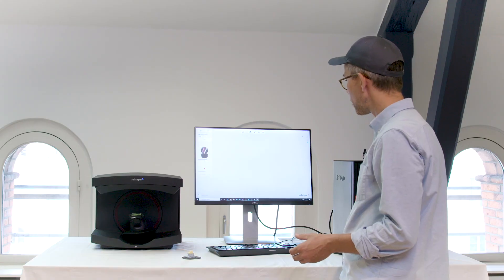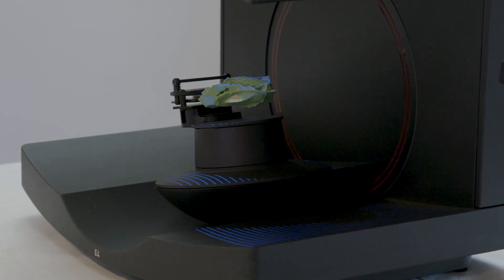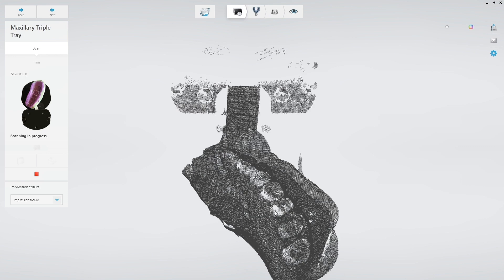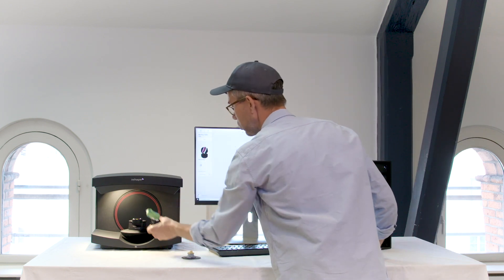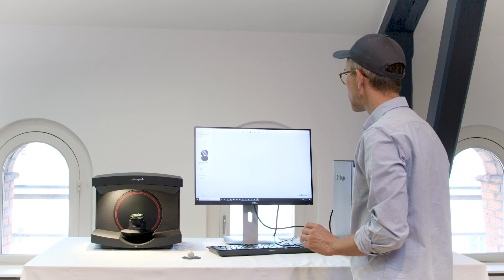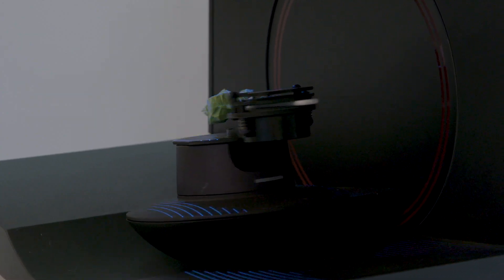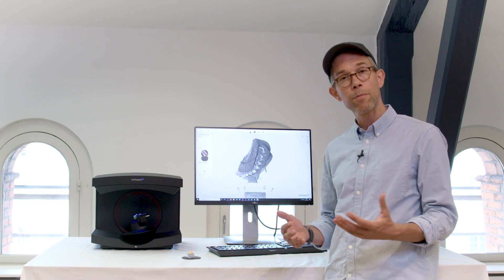It scanned the upper as a pre-scan. I mark my area of interest, which gives more detail in that area, and it does a swift scan on that side. Then I'll flip it around, take the other side, scan the details around the die, combine that into one model, and then I'm ready to design. I've scanned one side, flip it, go to the next step, and scan the other side. I can go back and forth between steps I've already done and start trimming — using my idle time to trim while it's scanning.